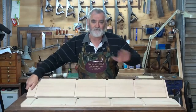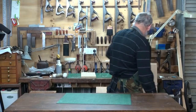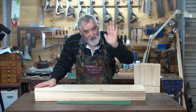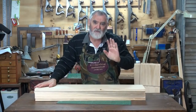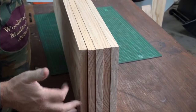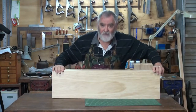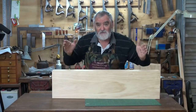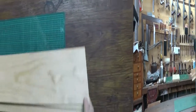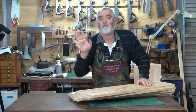So, move these out of the way — all cut and cleaned. Here are the shelves. Now, exactly the same as we did in part one with the shelves: don't trust the measurements that you get when you buy it from the hardware shop. As you can tell, they're not all the same length. So what I'll do is pop over to the drop saw and cut them all to length. I'm not interested in the actual physical length, but I do want them to be all the same length — so wherever they end up, they end up. There we have it: all cut to the same length. I don't know what that length is and I don't care.